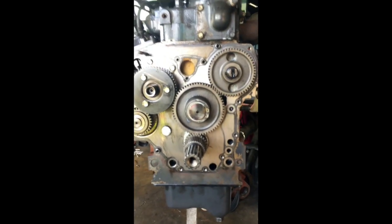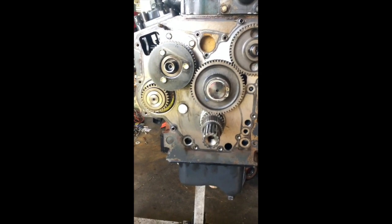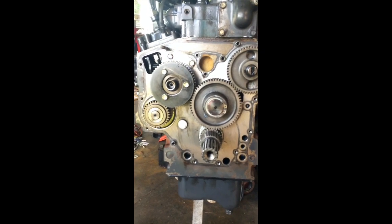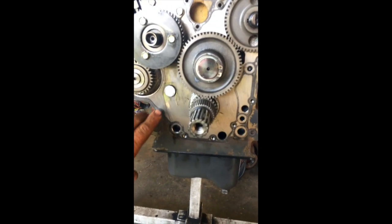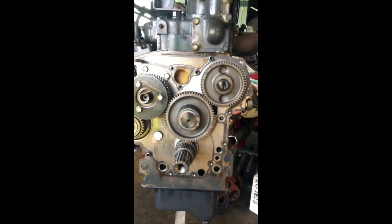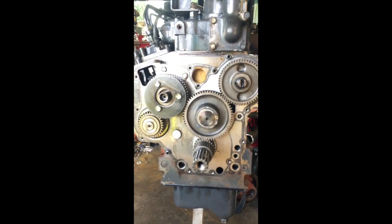And that's oil pump supply, discharge, and the filter in and out. So make sure you get the O-rings on there before you put your timing cover back on with the gasket. So, a couple of locating dowels, always try to keep track of those. So anyhow, that's it. I'm going to bolt this thing on and the motor is basically done.